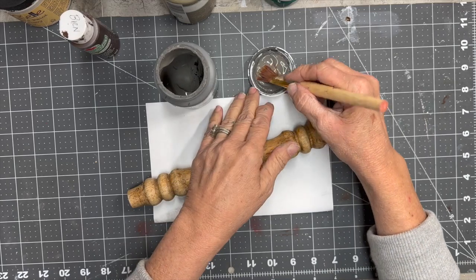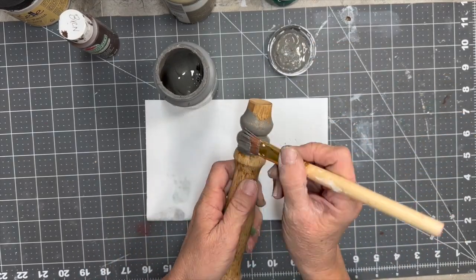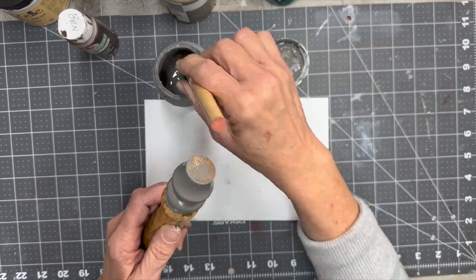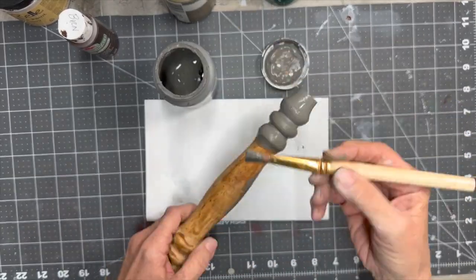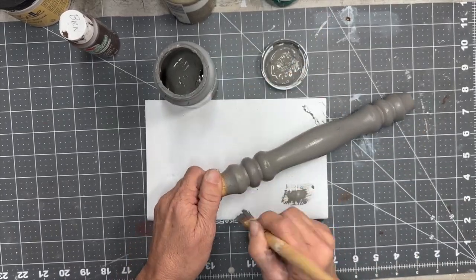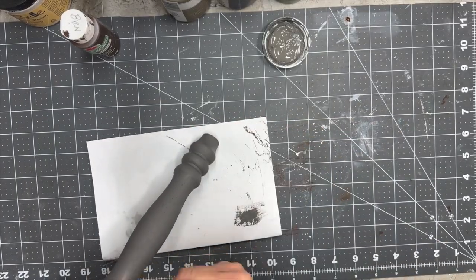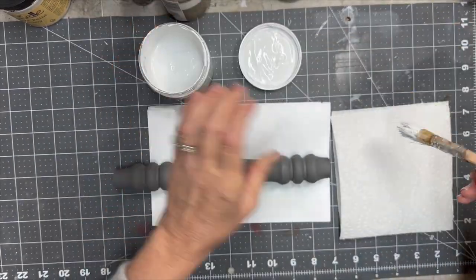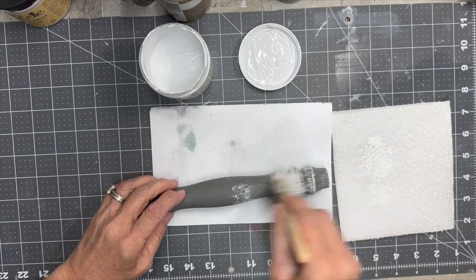Okay, do you notice that the spindles are getting shorter and shorter as we go up the tree? Okay, here I'm using my Elephant color by Waverly. And the paint was really thick, so it only took one coat. And this was that spindle that I used the citrus stripper on, and it worked really good. It didn't take all the stain color off, but it took that thick, shiny shellac finish off.